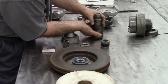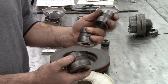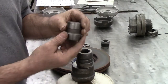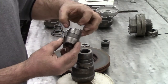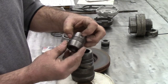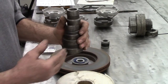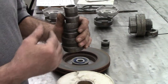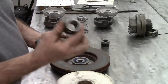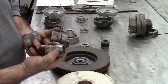Alongside these tapers, you'll also see these units — there are three of them. These are used if the hub or rotor actually has a tapered bearing inside of it. They are ball-shaped on each side so they set inside of a race. You find the one that fits and rides in the center of the bearing race. These come in progressive sizes. This type is only for rotors with adjustable bearings with races and cones, which is becoming non-existent. They can also be used as spacers because of the square ends as we build up on our arbor.